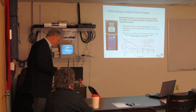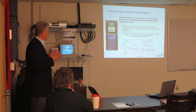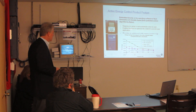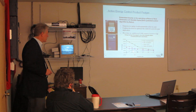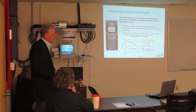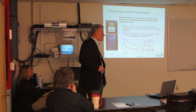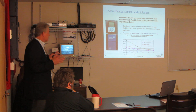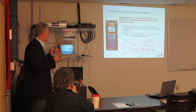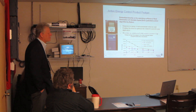One of the big things Johnson Controls has added — which I think is kind of nice — is that not only can our controllers actually save energy without a front end, now the VFDs are really set up to do this too on these new drives. They can actually provide up to 10 percent additional energy savings just from how the fan is being controlled — right out of the box. They monitor how the motor is running and ramping up, the times it runs, and they can adjust based on amps and other parameters. So you're really squeezing water out of the rock.